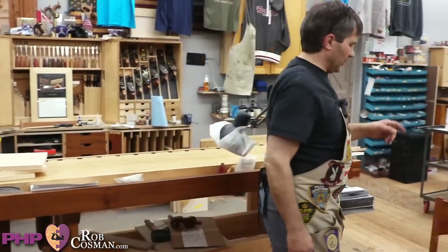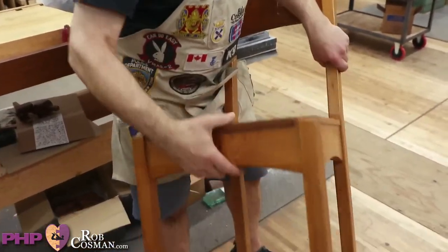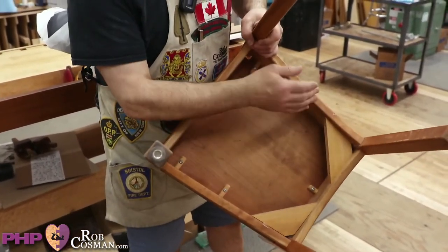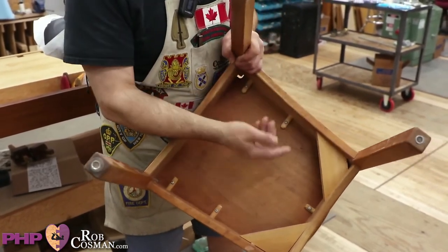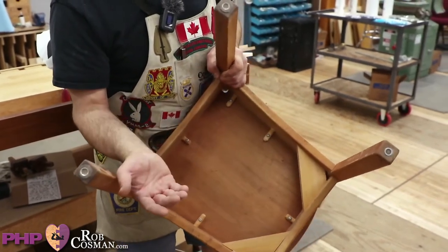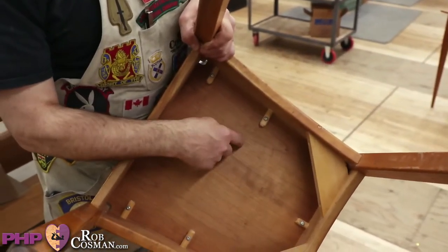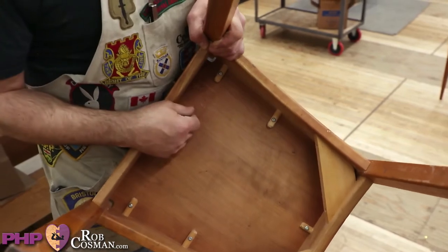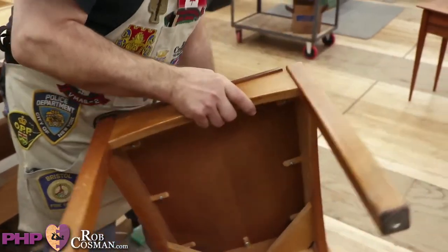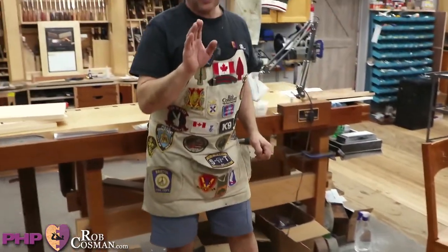So when we attach the top, that's a fairly wide piece. That stays nice and flat because of that joint. And, of course, you had to have that partial part of the circle wrapping around the dowel, hence the 300 of the 360 degrees. Why not 360 degrees? Well, I needed some flat part. I needed to flatten part of the dowel in order for it to get a good purchase on the inside of the seat. But I still have that part that's coming around, and that prevents it from cupping. That holds it tight to the frame, keeping it nice and flat. So not a problem at all.